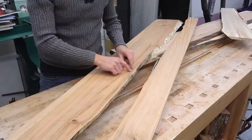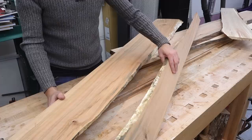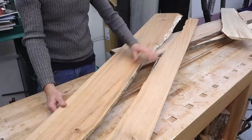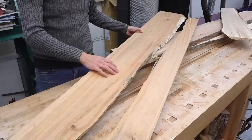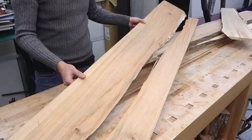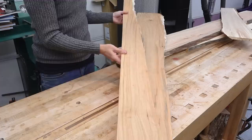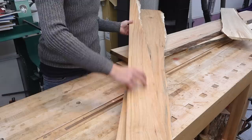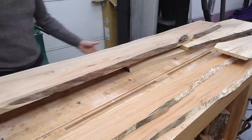First here is one of the boards from that cherry log that had a split in it. One of the things that split had done is some of the cracking extends into the field around the crack, and that area has a little more of a green tint from the rotting process that was occurring inside that existing crack. But as you get away from the center area where the crack is coming out, the wood is in just excellent condition — there is no structural issue here. There are some really cool blues coming in through here, which are pretty awesome. A nice bonus on this log is it actually has some curl to it — there is a little bit of undulation, so it does have some figure. Even with a board that's cracked like this, you can still have a pretty good amount of usable material — some really nice straight grain here, three inches wide of clear stock that could be used for just about anything like a door rail.